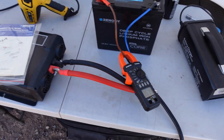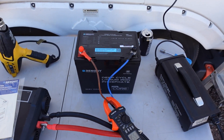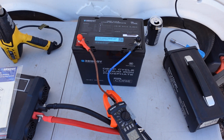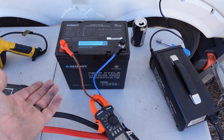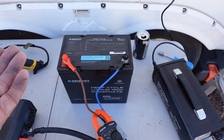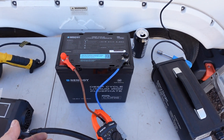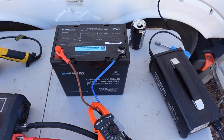It bounced up to 36 amps at right around 20 minutes. So it went from low deep freeze temperature — minus three Fahrenheit — heated the battery up past freezing, 32 Fahrenheit, and then a switch inside turned on and started charging of the lithium cells. So working as advertised.